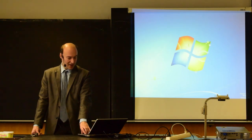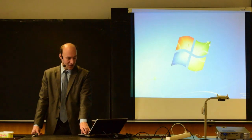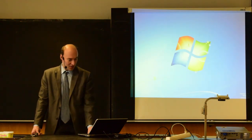So a Bourdon element is not that precise. The typical accuracy is higher than 1%. So it's definitely not better than 0.1. So here the correct answer is false. So that's it, and see you next week.